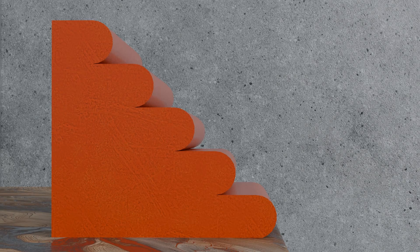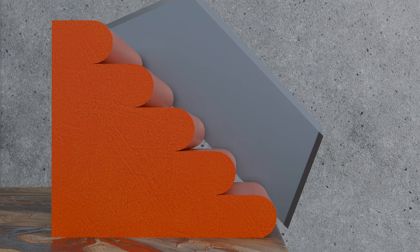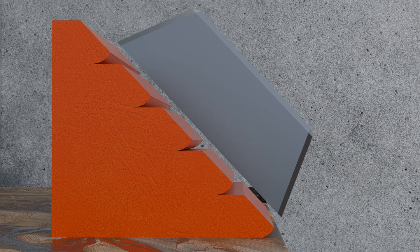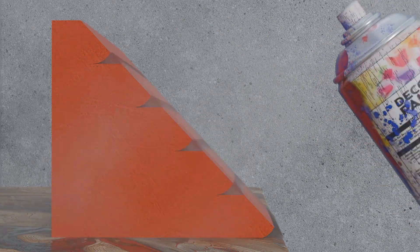The facelift begins with 3D printed molds. This close-up shows the issue with that, as these voids won't allow removal vertically. To fix this, I sanded the layer lines down with 220 grit sandpaper, and followed up with a lacquer spray to build up the dips and crevices left behind, creating a smooth surface ready for mold release spray and casting.